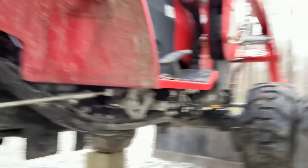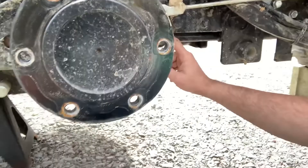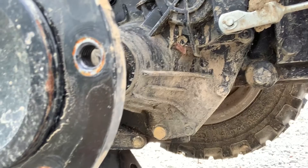Once you get that off, just roll it out of the way. It won't drop — it kind of rests on the axle, it's got a little lip here. So you pop the tire off and set it to the side. First step is right here — this is one of your drain bolts for your hydraulic system. You'll take that off and it'll drain.